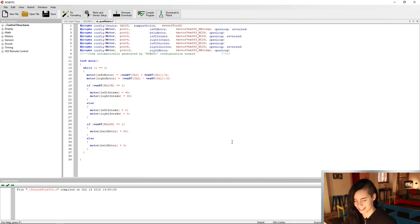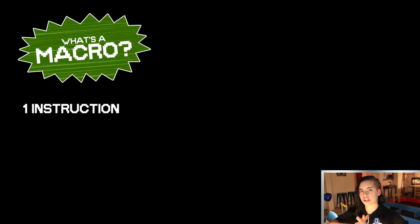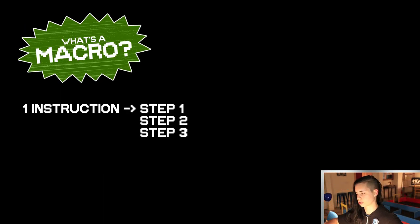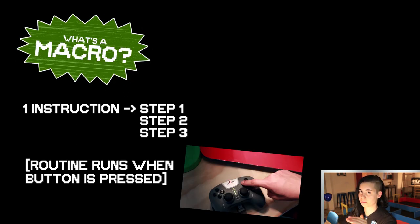Then we're gonna hold off on the shooter wheels for a second because we're gonna put those commands in a macro. Actually, not that different from the functions you set up for the cow tip battle. Generally, broadly speaking, a macro is a single instruction that gets expanded into a set of instructions. In our case, in the application of RobotC, a macro is a mini routine that runs at the touch of a single button. Gonna simplify the driving process big time.